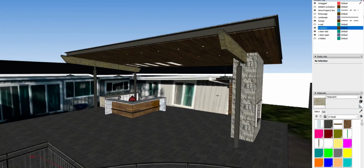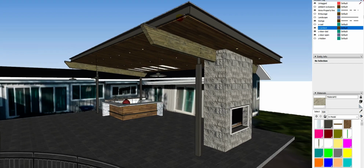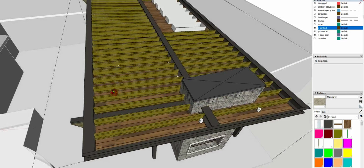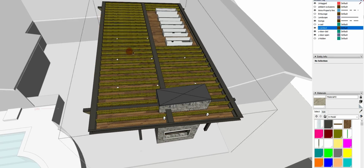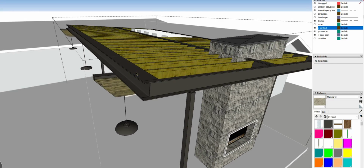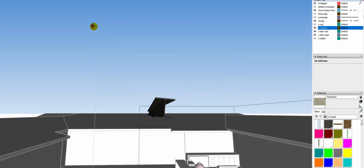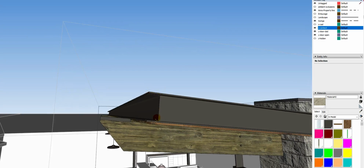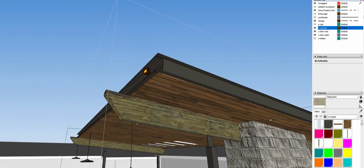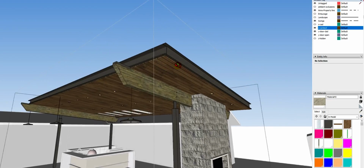And then also, given that the structural engineer is saying that we have to have some steel at these outside edges to carry the spans that you guys want here, we've got these steel beams in here infilled with some wood framing TJI members. But since we have to have this big beefy steel member out here, let's use this to form the outside edge of your roof overhang. I think let's express that steel. If you guys like this look, I think it's going to be phenomenal.